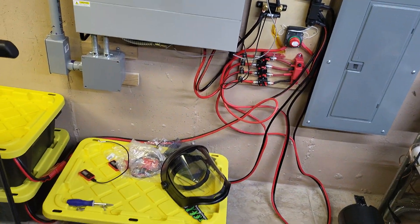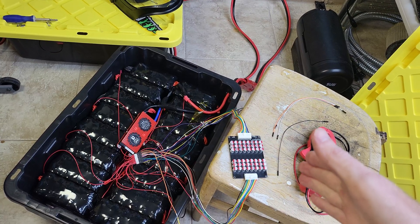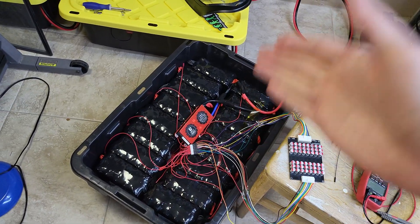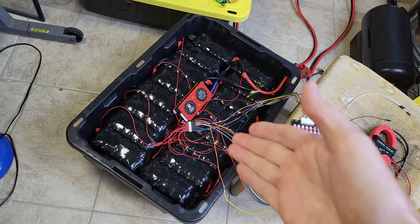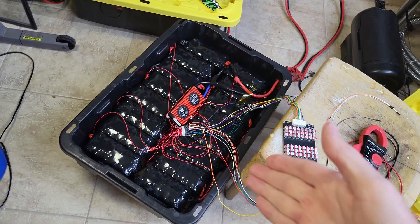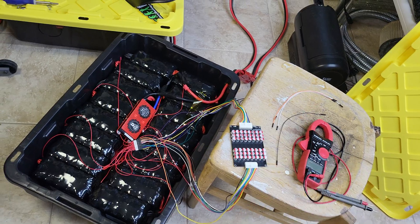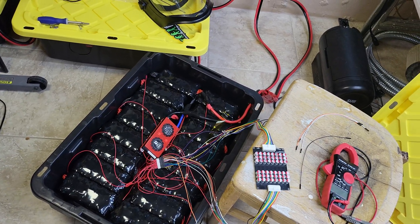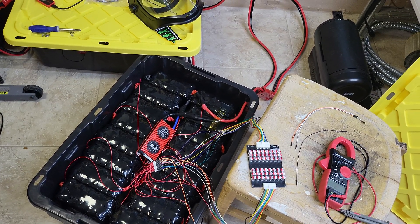Anyway, if you have questions, comments, or ideas, leave them down below. There's a 0.2 volt difference between the high and low battery module in here, and it's supposed to be balancing for sure — this is at the top of the pack where the BMS cut it off due to high voltage, so it should definitely be doing something. I'll update you guys soon. Give me a thumbs up and a subscribe — I'd appreciate it. Have yourself a good day, I'll see you in the future.